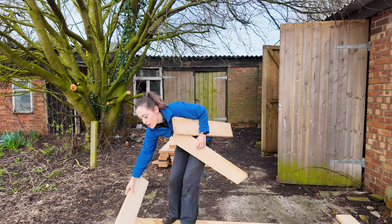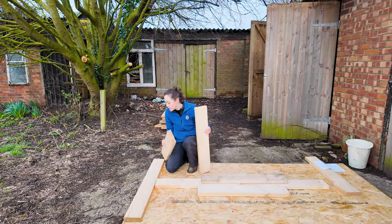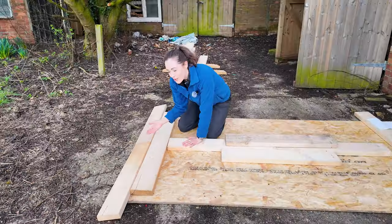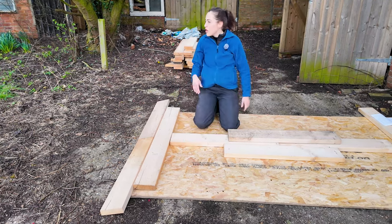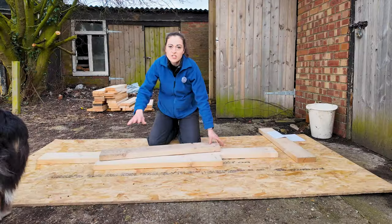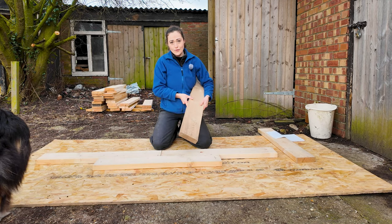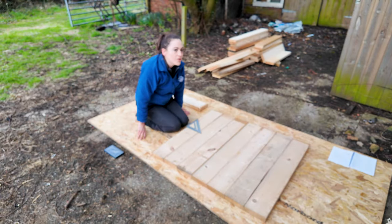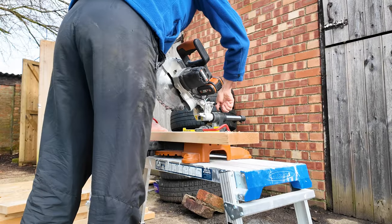For the shortest ends I'll use a longer piece, and because I don't need so many of those this works out well. I'll use the shortest pieces for the sides, cut them to fit, and that's all the off-cut I'll end up with. I know it's a lot of work with many cuts and loads of screws compared to using sleepers, but sleepers are so expensive and really heavy. It would have cost hundreds of pounds where this is just a box of screws and some battery-powered tools. I'm going to group these in pairs for the sides to have a nice production line on my mitre saw. I'll mark the halfway point and transfer that mark to repeat the cuts.